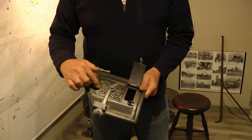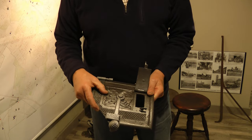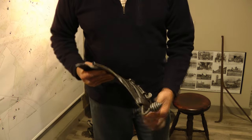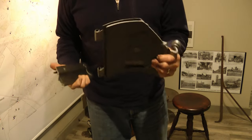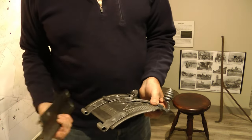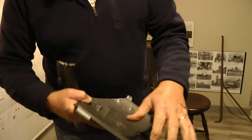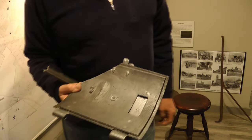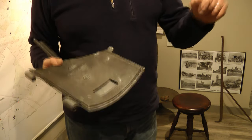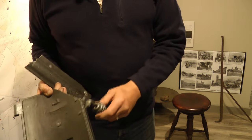The cast pieces were all made at the foundries and using a sand cast process. And then each of the items was assembled to each particular plate. And then the rivets, again, were all made by the blacksmiths in the area, heated and then pounded. And there was no welding or anything as such at the time, except forge welding, where you actually melted two pieces of metal together. So you have to think about all the work that's involved here.